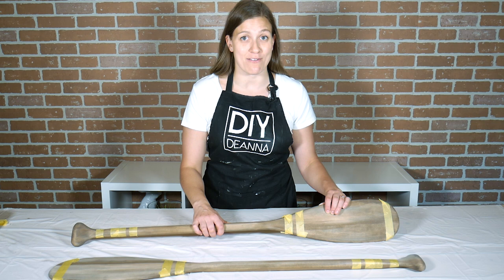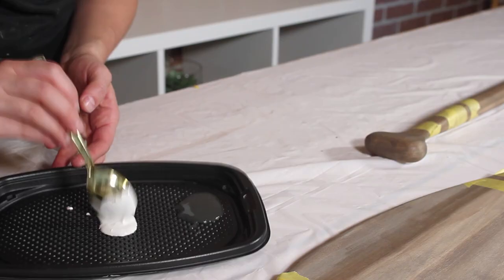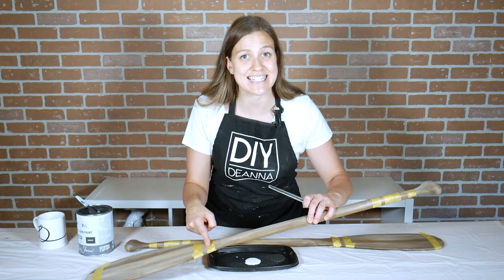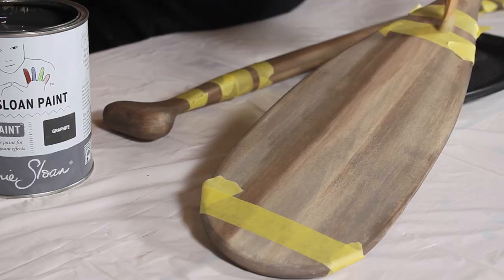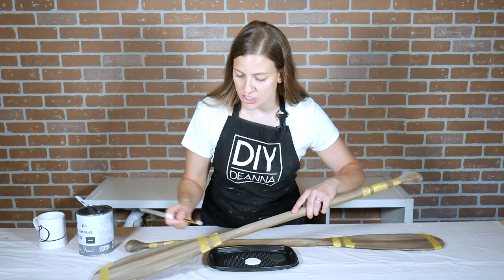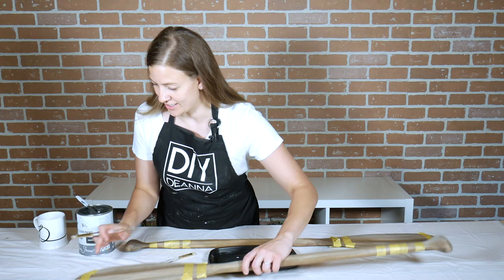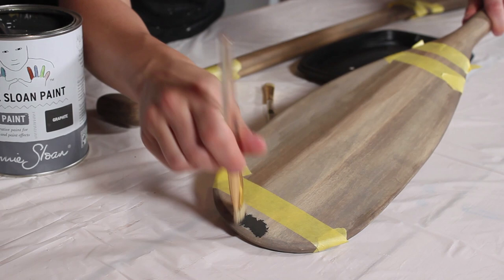I'll be starting with the spaces in between the tape. Once that dries I'll switch the tape over and paint the alternate sections. I'm going to be painting in the details with chalk paint — I've got some graphite and old white already scooped out on my tray and a couple of little brushes. As I'm going I'm going to push down the tape edge once more just to make sure it's nicely sealed. To help prevent bleed through, when I'm brushing I can do a pouncing or tapping motion, or if I do brush back and forth I'll just go along the tape edge. Dip your brush into the paint, tap off a little excess so there's not too much on the brush, and then start with the first section with a pouncing or soft back-and-forth motion.